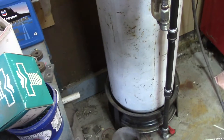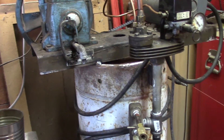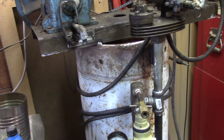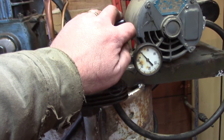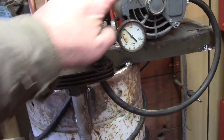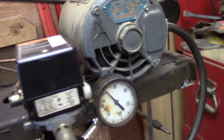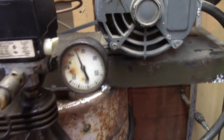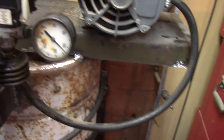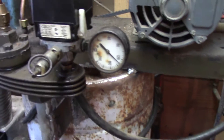Even the most ardent safety folks shouldn't be able to see anything too bad here — no welding on the pressure vessel. It's an old tank that had passed its expiration date, but I flushed and inspected it down inside. Let's turn her on and let it cycle. I mean, I don't know why I thought it might not work — clearly it's gonna work fine. 135 on the nose, bled down and bled off.